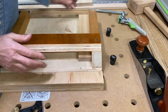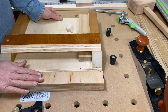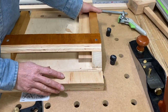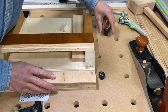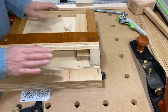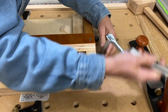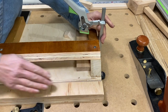One of the things that I like about the way this jig is set up is that it works well on the fest table, or I could put a cleat on the bottom edge and use it on my normal bench and just lock it into place. The advantage of using the fest table is that I can just put a couple of dogs in place to hold it, and I can put a clamp in place to clamp down my work and keep it from sliding.